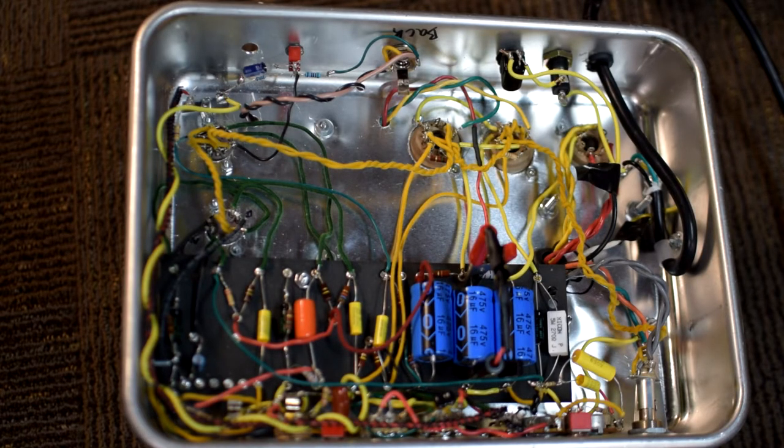Then the value of the resistor is also somewhat important. I think something even like 100 ohms is fine. If it gets too low, then you do run that risk of a shock or a spark. But if it gets too high, then it'll just discharge very, very slowly, and it might take like 10 minutes to discharge. I think mine's about 470 ohms, and that's worked totally fine for me. And that's a recommendation that I would make.